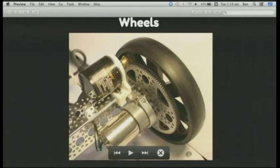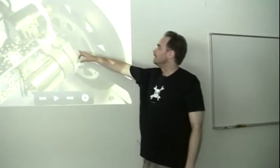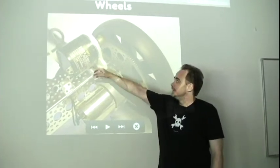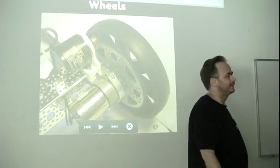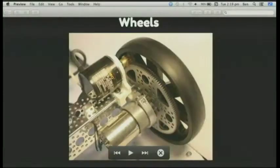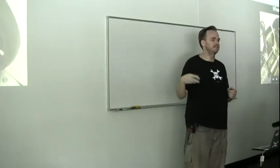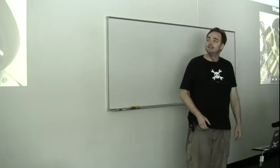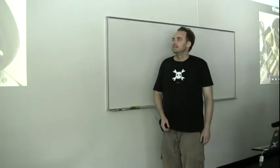This is a major differentiator between Terry and Tiny Tim. This is a motor that actually runs the wheel and there's an 8-to-1 ratio between the brass gear and the alloy gear. And this is a quadrature encoder — so it will actually detect 1,000 clicks per revolution, and with the 8-to-1 multiplier there's quite a level of precision when the wheel is turning as to getting feedback as to where the wheel is. Because it's all well and good to supply power to a wheel and say 'I've gone a metre,' but unless you actually get feedback telling you that you haven't actually gone a metre — you've gone 45 centimetres because of weight, slope, or carpet friction. So to do robotics where the robot knows where it is and can predictably move, you need to have feedback.